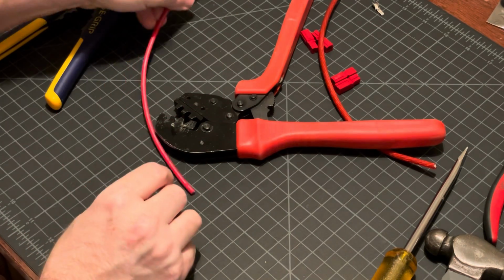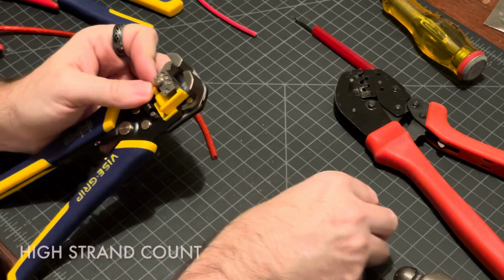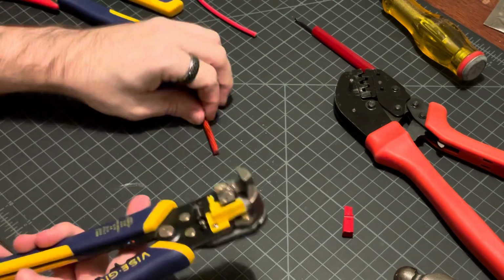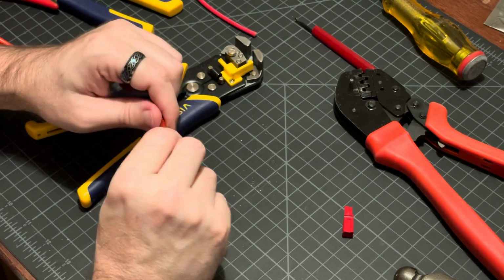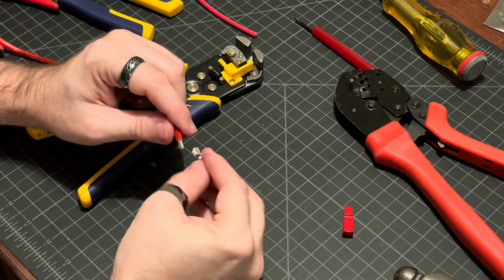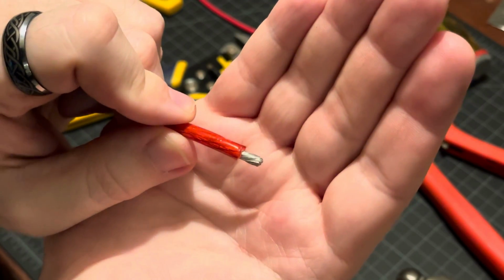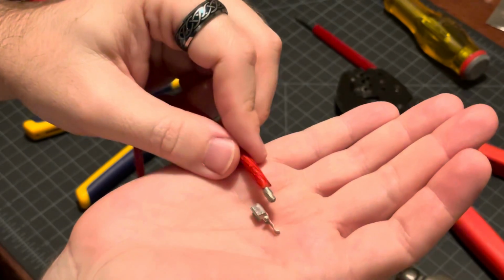All right, we're going to do the thicker cable next. All right, this is actually attempt number 2 on this wire. So I think what happened was our crimp was still too long, so I'm going to shorten it again. Okay, that looks really short, but I think it'll work better with these connectors. Let me check. Yeah, actually it's almost perfect. So if you can see how little I actually stripped off that wire by comparison. There's the connector. That's how much I stripped off.